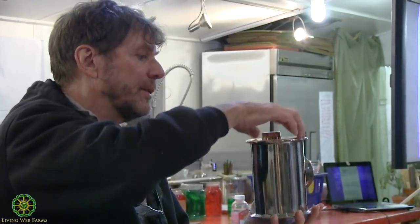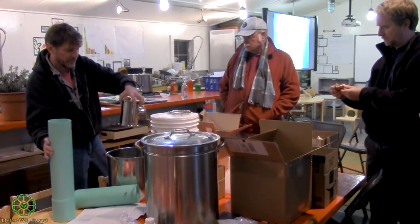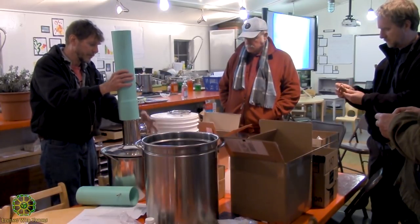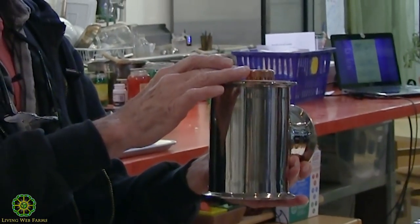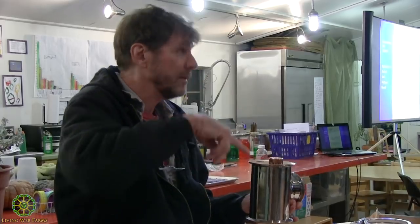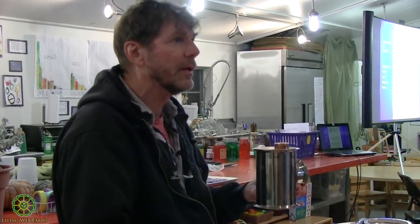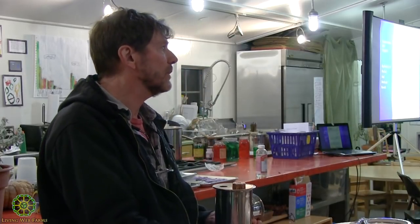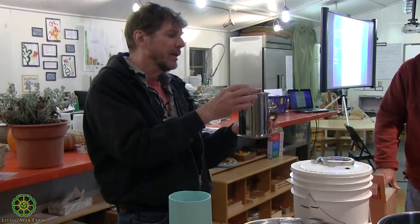The vapors rise up and the water drops down and builds up in the pot. As the vapor goes up through each of these levels, it bubbles through and separates the water from the alcohol vapor as it passes through the flood in each stage. The alcohol vapors go up to the next level and it does it all over again, while any excess water falls back down through to the lower levels, back into the tub — it still has some alcohol in it, so it gets driven up all over again.